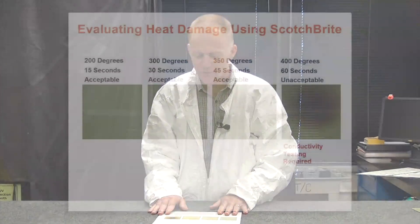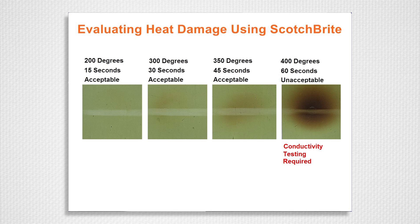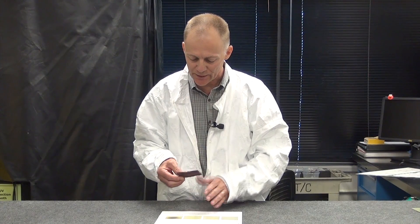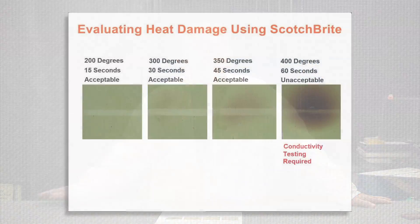Let's look at this illustration before us here today. I'd like to go from the left side of the screen to the right. I took all four samples and ran tape down the upper and lower portions, leaving about a half inch exposed. In that half inch area, I took some red Scotch-Brite — very commonly used, commercially available, something we use all the time in the aviation industry — and I rubbed that area down, trying to apply the same amount of pressure for the same amount of time on each panel.